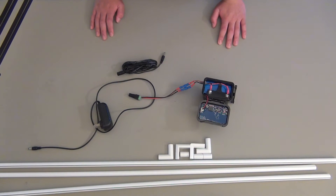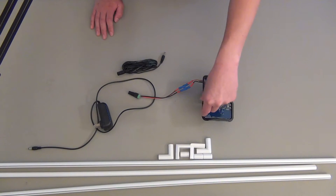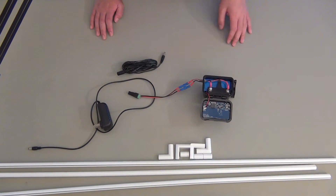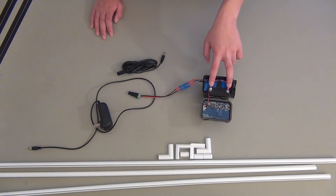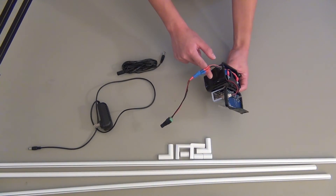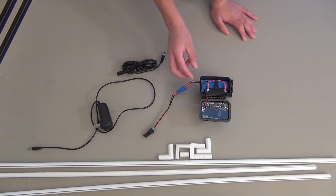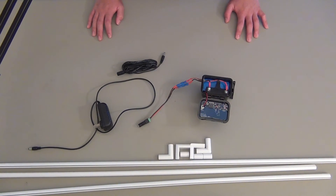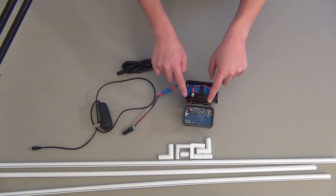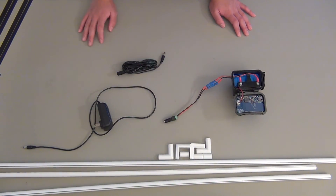The modifications I needed to do: before you modify anything, there is a piece of cardboard here with the Kohler logo on it — I had to cut that off to access the springs. I guess it's not absolutely necessary, but it does make it a bit easier. The other two modifications are drilling the two holes in the battery case and the two holes in the side of the case for the entire mechanism. One thing you should remember is that you should glue the holes or fill the holes with something so that water or the humid air isn't able to enter the unit, because if you look closely there is a rubber seal that goes all the way around — just a little precaution to make sure it lasts a bit longer.